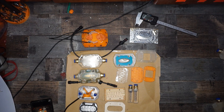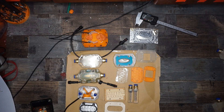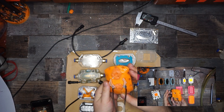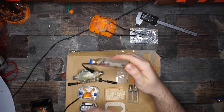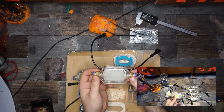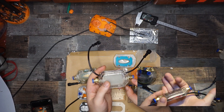Hi again! Today we are talking about the continuation of my water cooled LED project. For over 8 months now I have been working on building the perfect water cooling solution for those cheap 230 volt AC COB LEDs. The concept has evolved over time — check out the previous video for how earlier modules looked. The last generation were casted in resin but that didn't work out so well, so I decided to switch to another manufacturing technique.